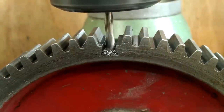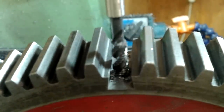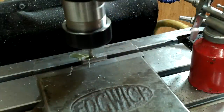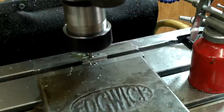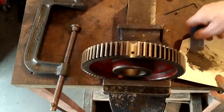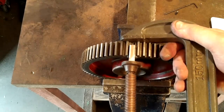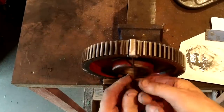Now for the belts and braces. I was going to fit a pin and then I thought maybe a grub screw — I ended up using a combination. I simply ground the tip of a 5mm grub screw to fit into a 4mm hole. Drilling the gear through the slot using a 4.2mm drill bit, I followed up with a 5mm tap to form the threads. The tooth was put back in the vise and I drilled an offset 4mm hole to 5mm deep in the dovetail side to match the tapped hole in the gear slot. For the braces it meant gluing the two parts together. Using acetone the parts were thoroughly cleaned, then plenty of JB Weld was worked into every crevice. I used a G-clamp and squeezed the two parts together, then finally fitted the grub screw tightly into place. I gave the JB Weld a couple of days to fully cure before continuing with any machining.